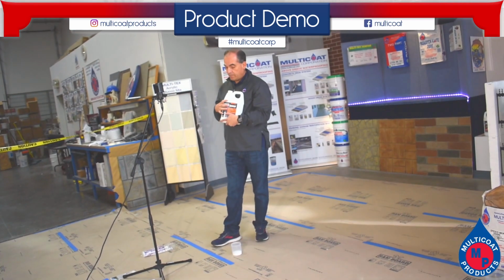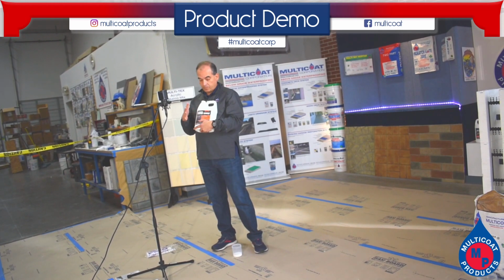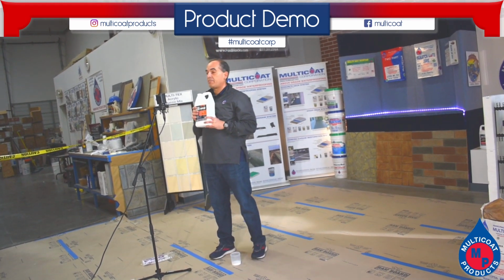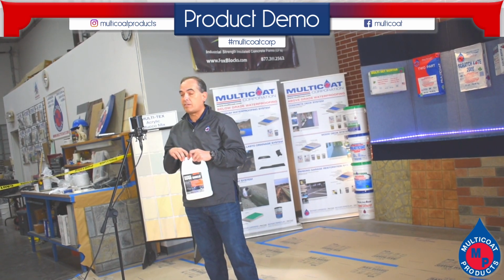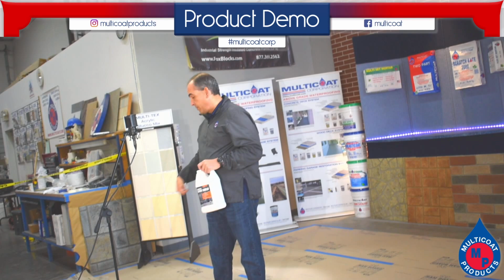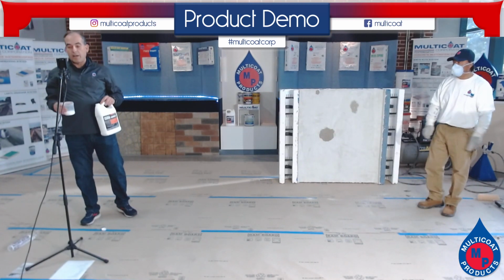It will also, if you apply it to a pool, sidewalk, a walkway, anywhere you're going to do an overlay, block 20 psi of pressure coming up. It will block efflorescence coming up. It's got no odor. It's easily applied with a pump sprayer or Hudson type sprayer. You basically do 2 coats, overlapping 50% from one coat to the other, and then mist water when you're done.